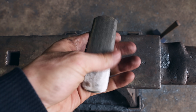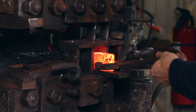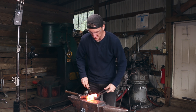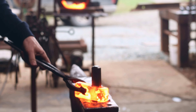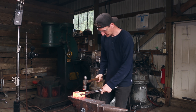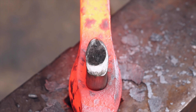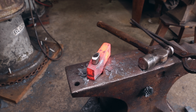So this is the drift all finished up here, ready to rock and roll. Let's try it out and see how this works — I have no idea what's going to happen. The first step is I'm just going to take the billet, go into the upsetter, run it through, and then we'll run the drift in. The top is definitely mushrooming — that's interesting. That's just with a three pound hammer and one push. So that's not great. Anyway, we'll push it out and try it under the power hammer and see what happens.